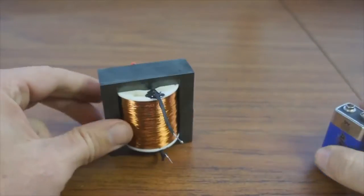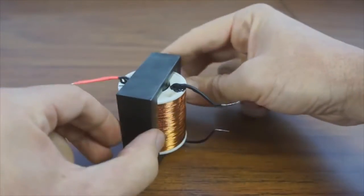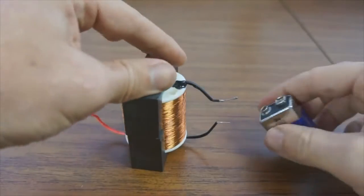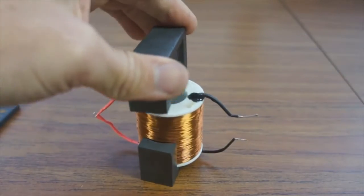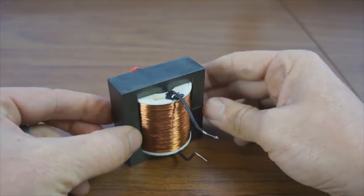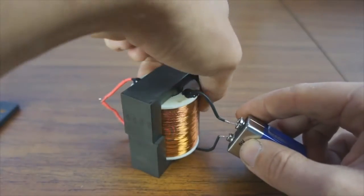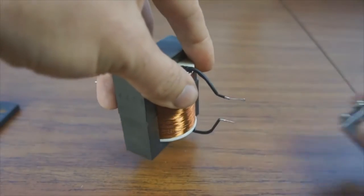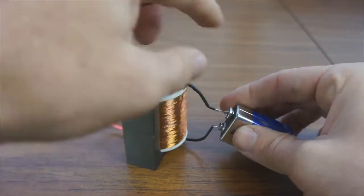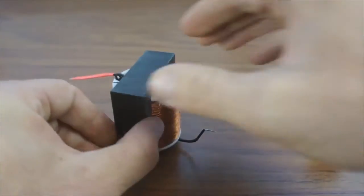Now it's very interesting to me, folks. That's a bit of a mystery to me. Obviously this coil is functioning in some way. I don't know if it's the inductance of the coil or what it is, to allow the magnetic latching effect. And I really would like to explore and see if the temperature of this coil makes a difference. I already put this in the freezer, and it seemed to me that after lowering the temperature it did hold longer, but I'll have to do more testing to verify that. It doesn't hold permanently like the soft iron does, but it holds for quite a while. So you can see the length of time that it holds there. And if you compare that to without that shorted coil, you get just nothing. Just instant release. So very fascinating.